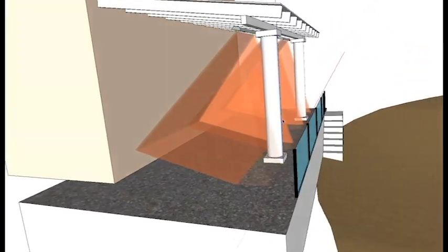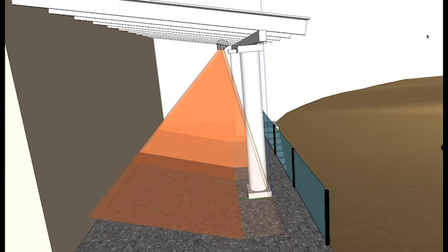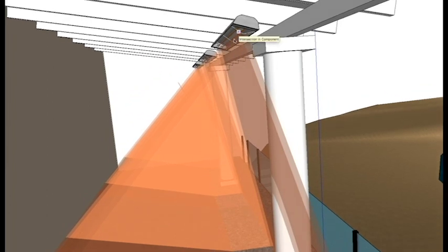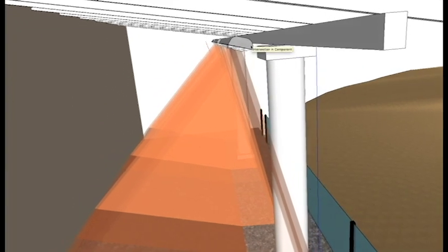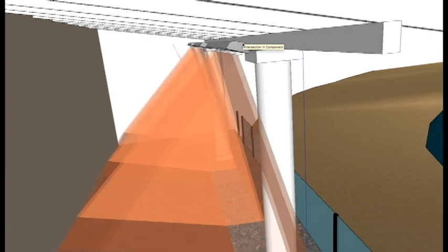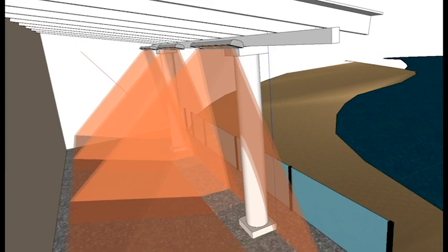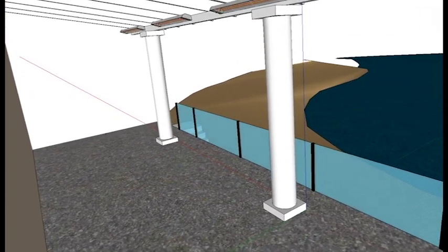Now the benefit of having Infratech electric heaters in this environment is the fact that air movement doesn't affect any of the operation of the heater itself. So the heater itself is going to run effectively 100%. That's something to consider with the application, as well as the fact that with the Infratech we're also able to reduce the clearances to combustible because there's no exhaust flowing up here. And with this view, obviously we are able to stick the heater up a little bit higher, so that it's not protruding down into the space as much.